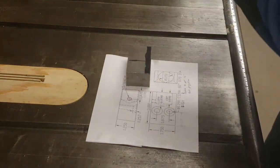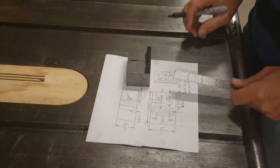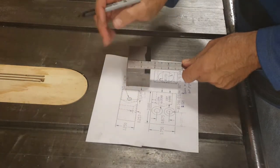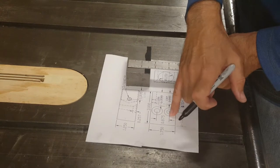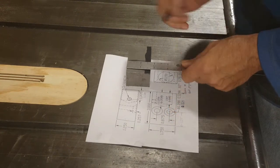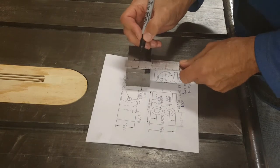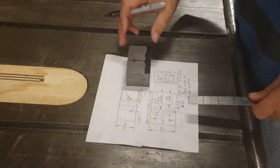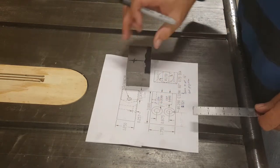And they're 7/8 of an inch apart, which means, let's see, 1 3/4 is 7/4, so half of 7/8 is 7/16 of an inch. So they're going to be about here and about here. So I want some Dykem there, and then I want to make the mirror image of this part.